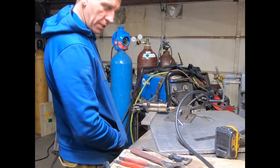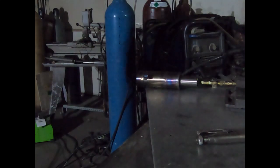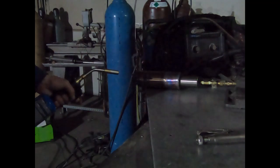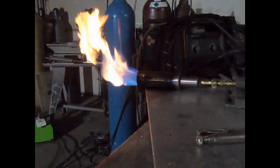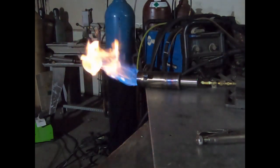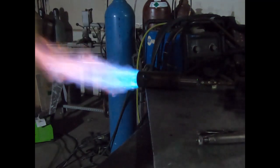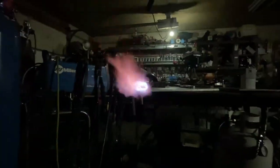It just has to melt some tar on a blacktop — on parking lots. We need combustion in this back zone. Things don't always go as planned — it's a secondary vaporizer. I think we've got it now, but we're going to have to change the front a little bit. I've got a pre-mixed tube on the back of this thing because we still needed better pre-mixing to get that rear combustion chamber going. We weren't getting any fire inside of it, but now we're getting good interior combustion inside the burner tube itself.